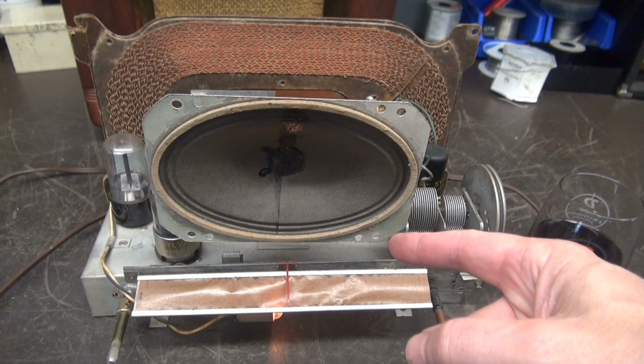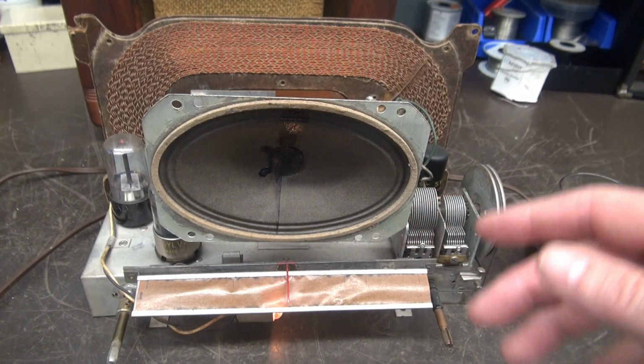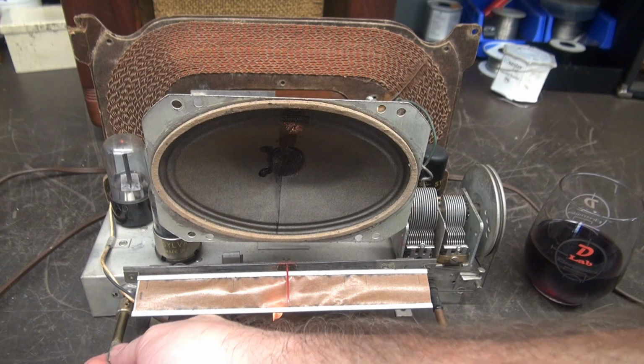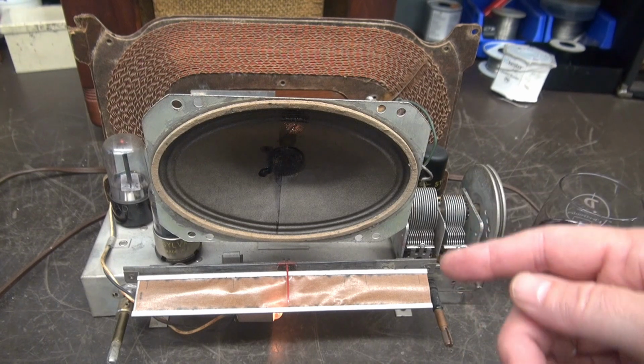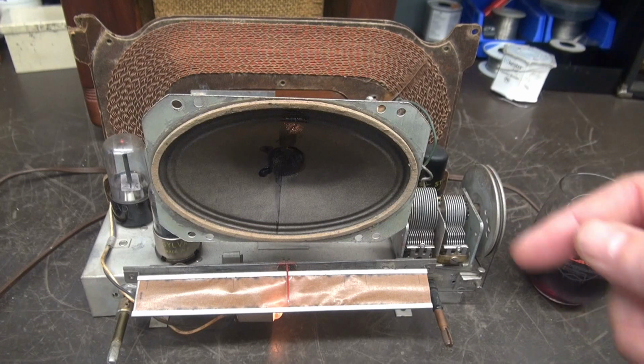Do you hear what I hear? Hear those snap, crackle, pops? No, there's not Rice Krispies inside. There's something going on with the radio generating noise even when the pot's all the way down. So it shouldn't be passing any audio, right? But it is. So you hear the pops? Let's put it on a scope and see what they look like.